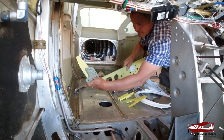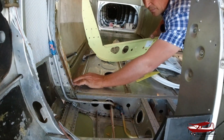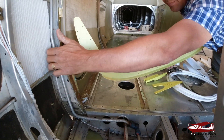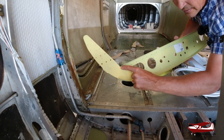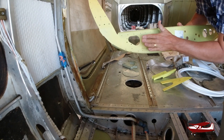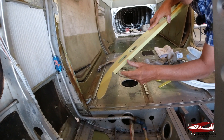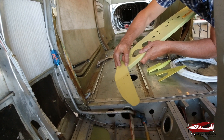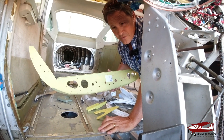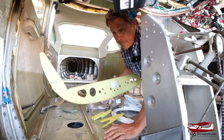Both sides are sitting in there like that. Now the place that it cracks — that you have to inspect — is very difficult to see with the interior in the plane. This piece is this piece. Here's the shelf, and here's this piece sticking up here. They crack here in this tiny little U-shape. This is a very thin bit of metal, and there can be flex there, so you get a tiny crack. The crack can be barely a tenth of an inch down, or it can go deep. The time you have to inspect for this AD is around 4,000 hours — there's a mandatory period, and then a time before that to inspect.